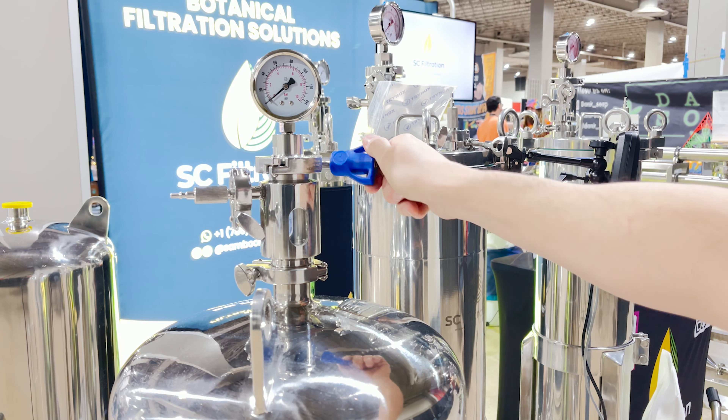One cool feature is the option to use neoprene jackets. These jackets zip on to any size housing and help reduce the amount of condensation that builds up, keeping your housings cool. The system is also mounted on a large drip tray, which acts as a drip pan — since inevitably there will be some leaks — with a drain to collect any spilled miscella so you can recycle it. And your entire system is mounted on casters, making it incredibly easy to move around your lab for cleaning and maintenance.